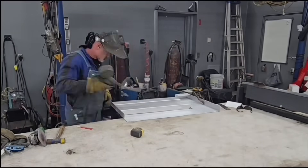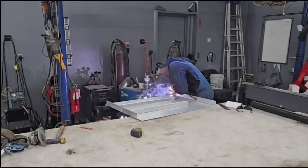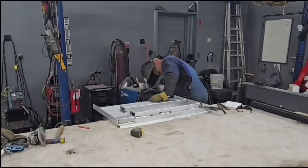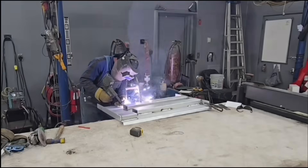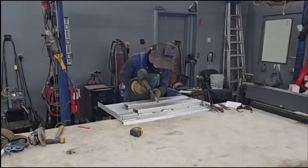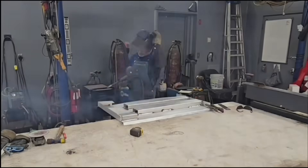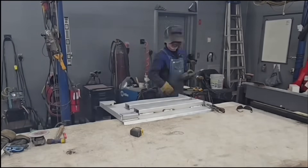Tapping and tacking, getting things squeezed together. I have to put the blanket on my steel table because the steel scratches aluminum really bad. But when you weld, make sure you're not welding right over that blanket — because when you melt it, it sticks to the aluminum and you've got a mess to clean up. I've got a jack stand on the floor next to me and I'm pulling the piece towards me, using the jack stand to get the welded areas away from the blanket. I also use it to squish things together — put the jack stand in the middle, push down, and work the positioning to get it to close up.